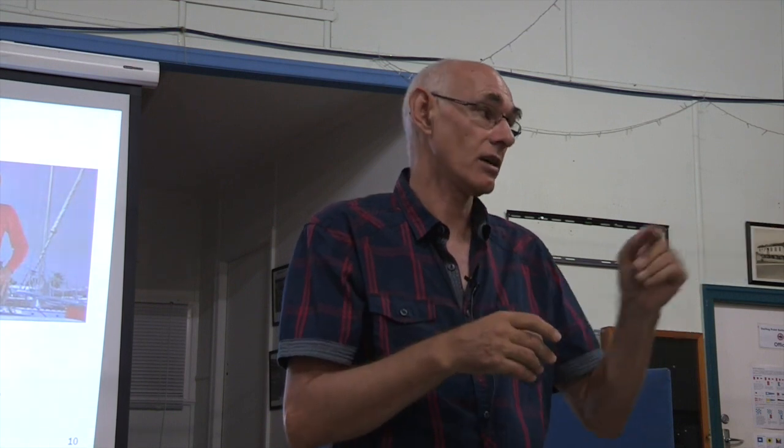And then they say, okay, we'll do a similar thing with this. We'll size it on strength. We'll knock it down to 30% so it won't creep. I've just told you it doesn't creep. So we've knocked it all down, and at some point we're going to have to wake up and go, oh, instead of using a 20mm cable, let's use a 6mm cable.